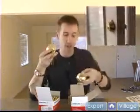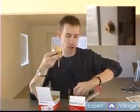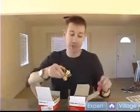However, if you do have a window or glass right next to where someone could break it and simply reach in, then you can put in a double cylinder deadbolt, which is keyed both on the inside and out. You want to check regulations in your area to make sure you're not violating fire code. If you do choose to use a double cylinder deadbolt, we recommend that you leave a key in it whenever someone is home and only take it out if you're going to go on a long or extended vacation.